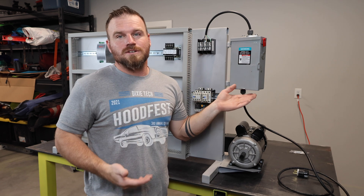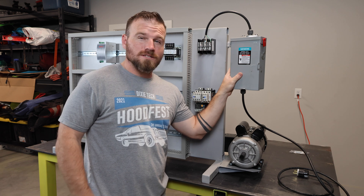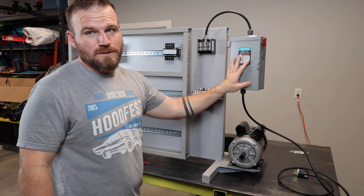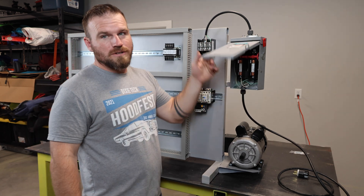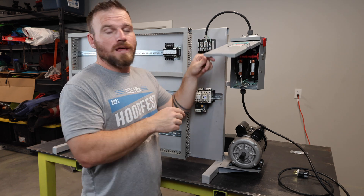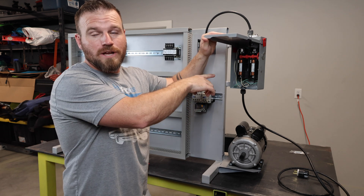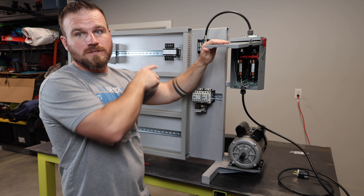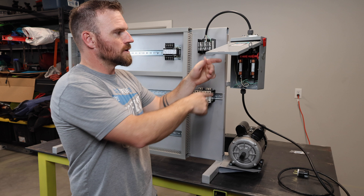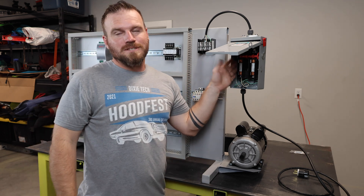The disconnect just makes life easier. They're not cheap — this one was about $70, and some run $150 to $200. On student trainers I've built, I put a one-amp breaker in before the transformer. Students often wire transformers directly to ground and blow them, but that little breaker saves a lot of transformers — because accidents happen.